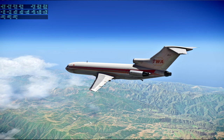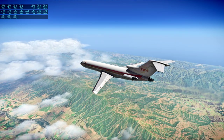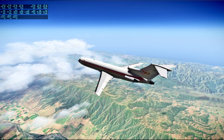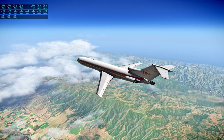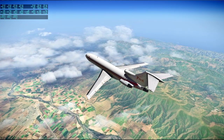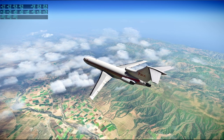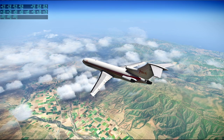[Apollo 13 audio] I read you until after turnoff bat six. The question is: we only want one that has been on bat six on the line, immediately followed by turning off four descent bats — is that correct? That's affirmative. We're rating current of 11 amps right now. Okay, I guess I'm ready. After you turn bat six on the line, we might as well take a look at bats one through four to make sure it's okay to turn them off.